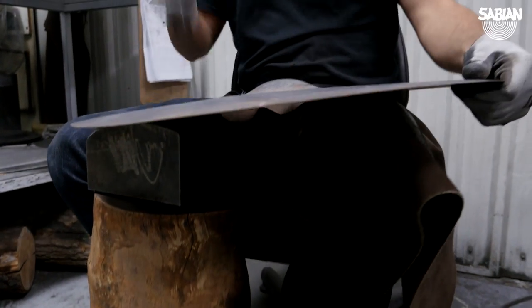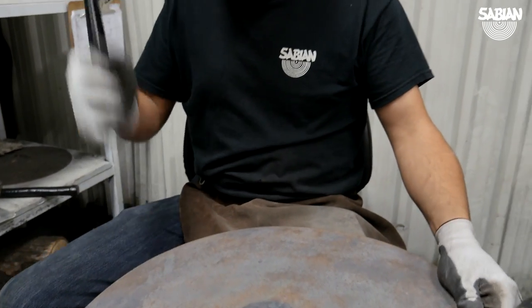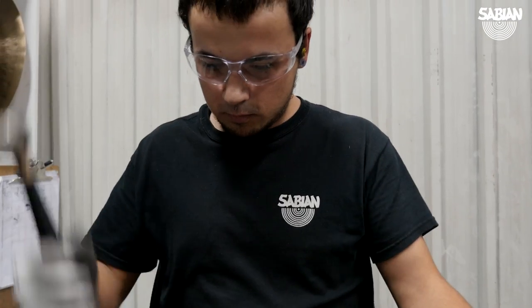The anvil is a big piece of steel, also quite tempered, nice and hard, and it sits on a log — more or less in the log actually. There's a hole cut into the log and there's a big cylinder of metal on the bottom of the anvil that sits inside there and presses against the anvil, creating a nice tight grab on it. The vibration drives down through the log instead of up through the anvil and into your arms, which just makes it easier on you.